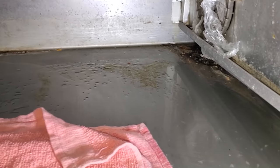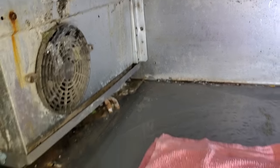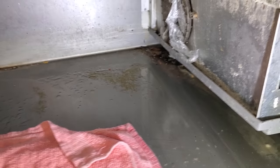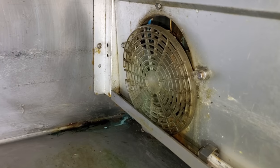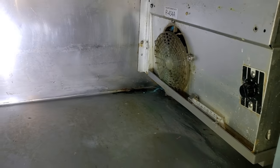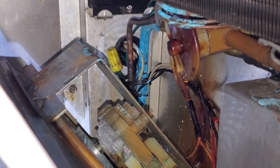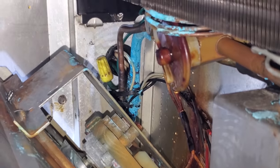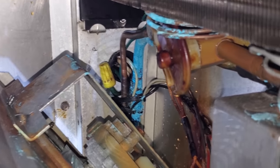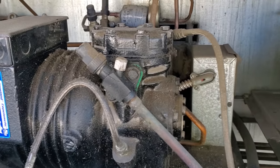This one's pretty beat up. It smells like death in here and there's some pretty grody stuff going on. The drains are plugged up too because it's full of water. I'm just going to do a leak check real quick. This one, right off the bat, has a bad fan blade — it's shattered. We're going to keep leak checking. So far, no leaks. See that blue stuff down at the end? You can totally tell what the salad dressings, vinegars, and citric acid does to the copper lines. It's interesting — I'm not finding any leaks.